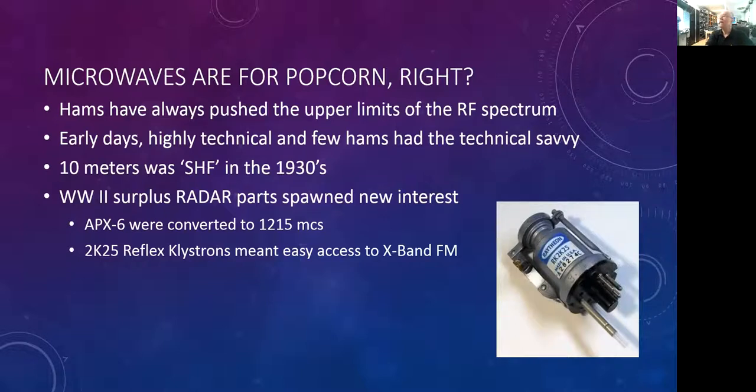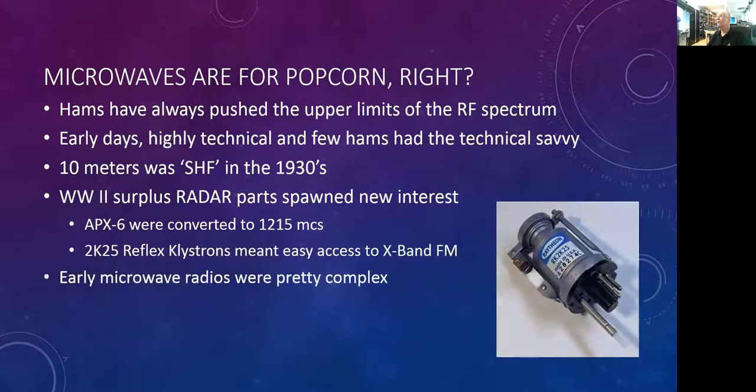You can see it's got a little built-in probe — that's actually a quarter-wave antenna in X-band sticking out of it. This is actually a coaxial feed, but that's the actual antenna, the X-band oscillator. These early radios using this hardware were kind of complex, especially using the 2K25s. It took a lot of equipment — a modulator, power supplies, and a receiver to use these devices.